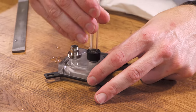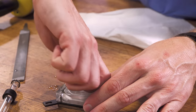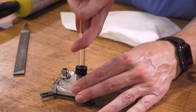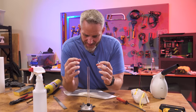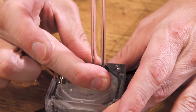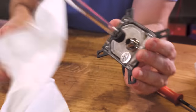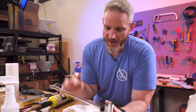Here's something people tend to forget though — when it comes to glass, you obviously can't just squeeze on it like crazy. You're gonna have to find the right amount of tension where it doesn't leak, but at the same time it's all the way down in there and seals completely. So just kind of twist it as you work it in there — see, that slid down in there. Now the collar is where it's compressing that O-ring against the outside diameter of the glass and against the outside of the bore of the compression fitting. The clarity of glass versus PETG or acrylic — look at that. There's just nothing like it. It makes me want to do another glass build.